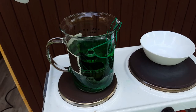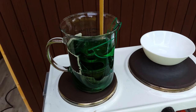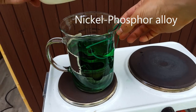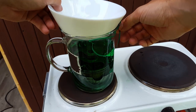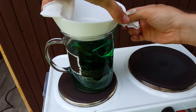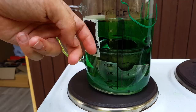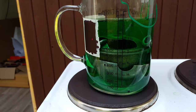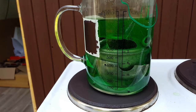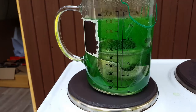The nickel solution was activated with a second liquid. Let's talk a bit more about this now. In a chemical reaction, nickel, or to be precise, a nickel phosphor alloy, bonds to the metal part, creating a robust surface layer. According to what I read, the resulting layer is harder and more durable than traditional galvanic nickel plating. Which was the main reason why I chose this method, because this meant that the chance of any nickel rubbing off was minimized, preventing further corrosion in the future.